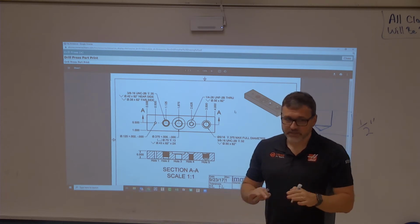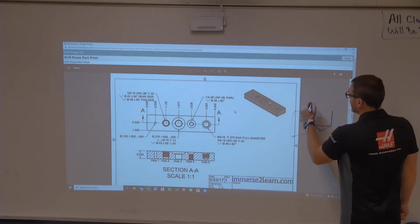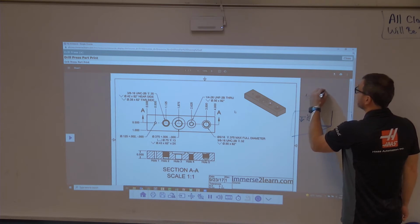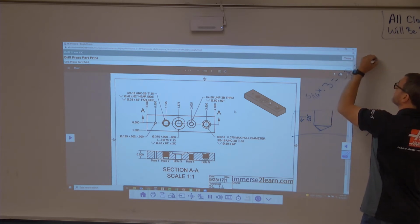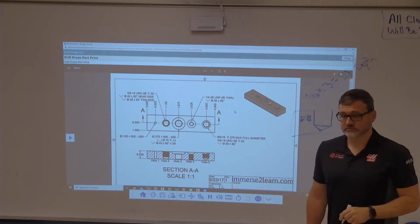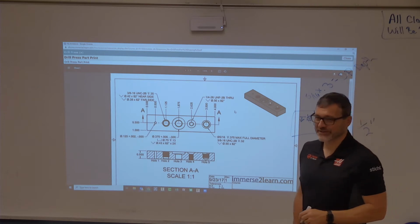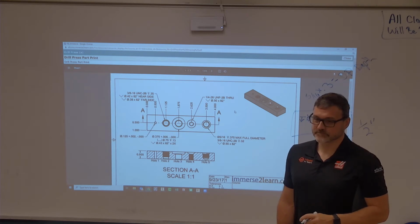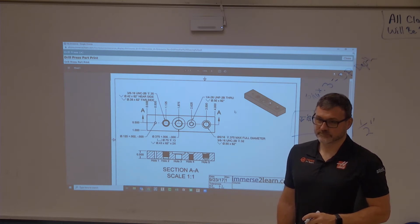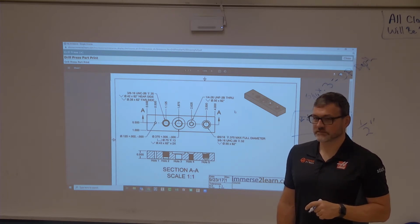There's a pretty simple way, and we'll get into more depth on how to do this, but the simplest way is to take the drill diameter, so 5/16 times 0.3 equals the drill point depth. Alright, so it's 5/16 times 0.3. We got one lone calculator person. What's the decimal equivalent of 5/16? Eden, what is it?